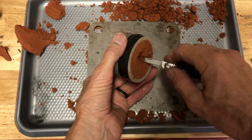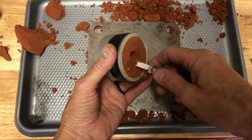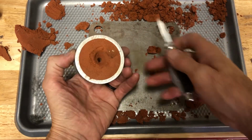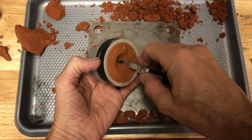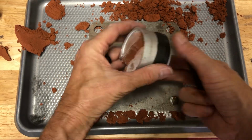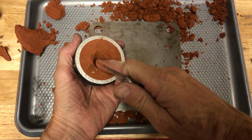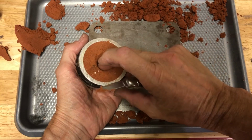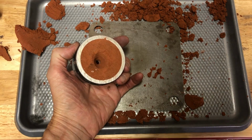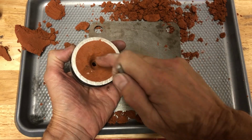And at this point, you want to take a small pocket knife or some other tool, and we're going to cut the funnel where the metal's going to pour. And I like to make it fairly small and directly straight down. Nice taper. When I pour the metal in there, I want to make sure that it doesn't run into anything, and it knows pretty much right where it needs to go. And any edges I like to pat them down.